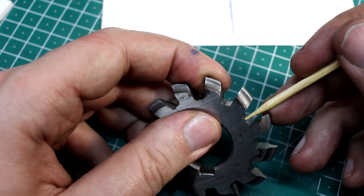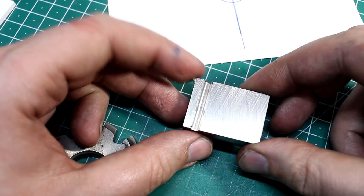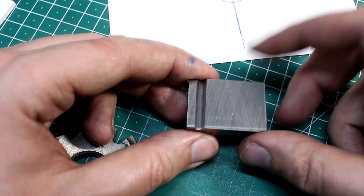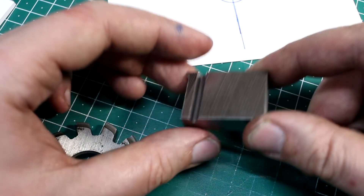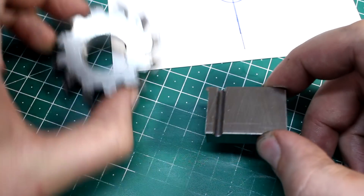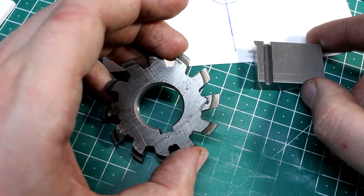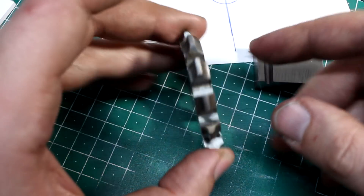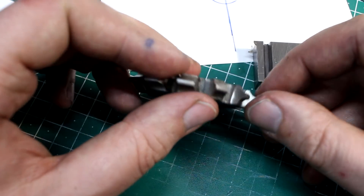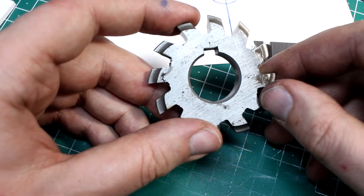I could not be bothered to clean up the bottom of the gullet here completely - I just whittled away some of the material. Here are the test pieces. The surface finish is quite decent, but that's inherent to the material. The better tool steels like A2, D2, O2 machine quite nicely but are reasonably hard on tools. It looks like we get the correct profile again and the cutter is cutting, which it was absolutely not able to do before the regrind - so that's quite nice. That was my five cents on resharpening a relief-turned cutter. Hope you enjoyed, hope I didn't mess up too much. Thank you all for watching and see you next time.